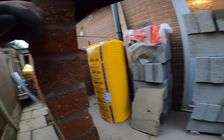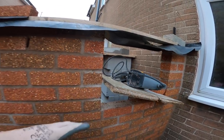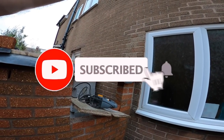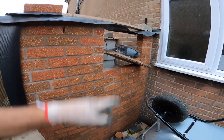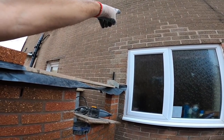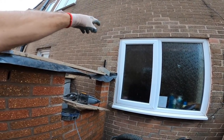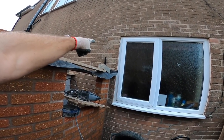So this is us so far. We're up to trestle height, loaded out ready. She's just getting the profiles. Windows set out. He's just going to re-drill some holes. If you use the crates, you'll be able to get the last two, or the step ladders, and I've got some solid floor to work off. If you go up on the outside skin, go up 4 courses, just to make sure we don't go too high, and then on the inside skin, go up an extra course. Because the inside ones are of course lower, aren't they?